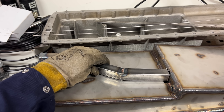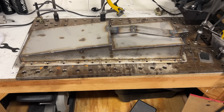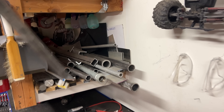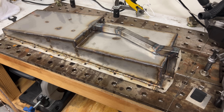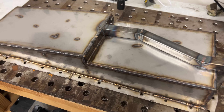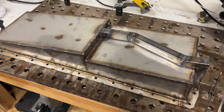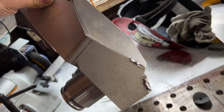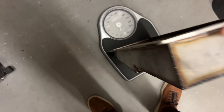Right about the time I finished welding it in, I realized something important. After I sent off the parts to be laser cut, I ordered a one-inch square tube of stainless steel, and when it arrived, I put it on my shelf of random metals. Then, when it came time to bend and weld the tube on the oil pan, I took it down, cut it, bent it, and welded it to the oil pan. Pretty much right after it was all welded in, I grabbed the rest of the tube and noticed the label — I grabbed the wrong tube. It's not stainless. All this pan is stainless, except this part right here. It's not the end of the world — you can weld stainless and mild steel, the pan will be fine. I should have made this whole pan out of mild steel, or actually aluminum. I'm always reluctant to make things from aluminum because it's tough to weld, but I'm starting to realize it was only tough with my previous welder. With my new welder and a few hours in welding class, it's actually pretty easy. You know, if nobody was ever going to see this pan, I wouldn't have used stainless. So this is kind of your fault.